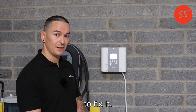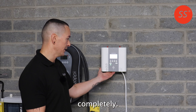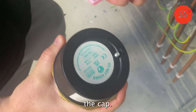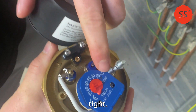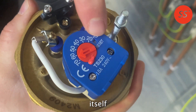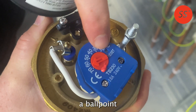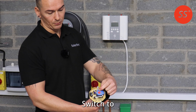To fix it, what you must do is turn off the power to the Eddy completely and remove the cap. It's usually a little nut on the top which is only hand tight. You can take the cap off, and on the thermostat itself there is a reset switch. Simply stick a ballpoint pen or something small in at the reset switch to press it down.